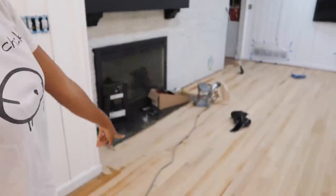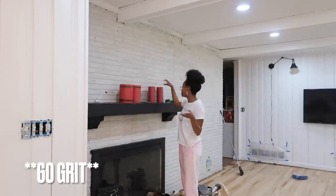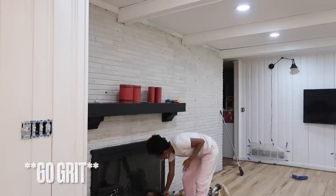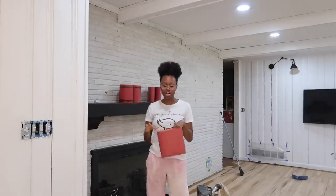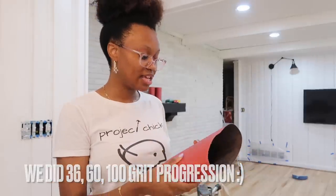Hey guys, I want to give y'all a little update. So I went out to get us some lunch. We're starving. And while I was gone, Marcus was working on edging. So he's going to continue doing that, and I'm going to go ahead and begin doing the 80 grit on these floors. So first we started off with 36, as you guys know. And now we are going to move on to 80. And then after 80, we are going to do 100 to finish it off. So yeah, I'm hoping that will go super duper smoothly.